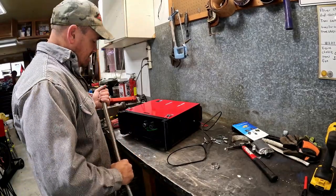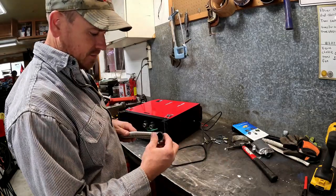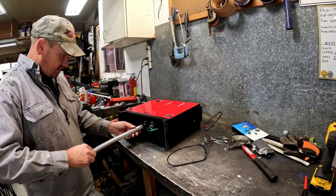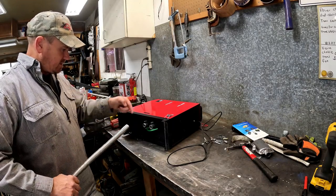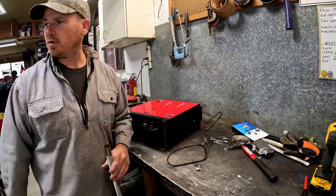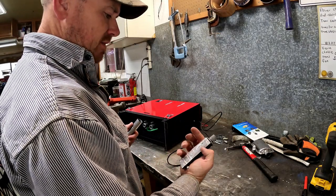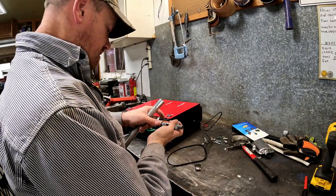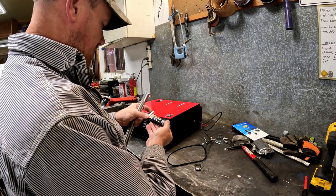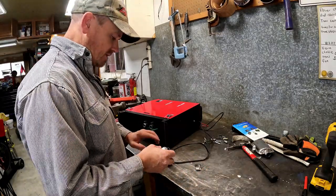Well, I guess we're on to the diesel heater install. It looks kind of like they want you to clamp this pipe on there. I'm a little worried about gas. That's not a very good fit. It does look like they give you a hole though for your screwdriver to fit in, which that's a bonus. I'm gonna go a little bit more. We're gonna put in some of this gasket maker. Should be high temp. I didn't really pay attention. Permatex, the right stuff. 90 minutes, flexible. Well, even if it's not, it'd be better than what it has.